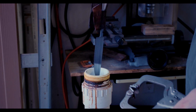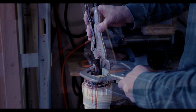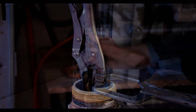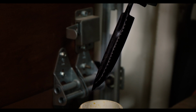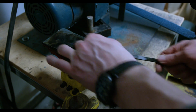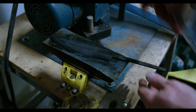There are many different ways to bring out the pattern in the steel, and here I'm showing my standard routine. I start with a 10-minute soak in ferric chloride. This coats the surface of the blade in black oxides, but the nickel steel and the high phosphorus wrought iron stand out clearly. To remove the oxide layer, I do a quick polish on 600 grit wet sandpaper.